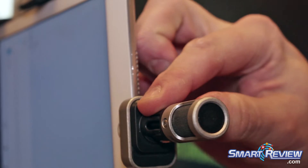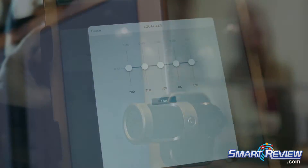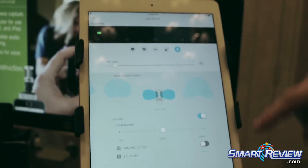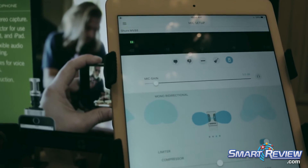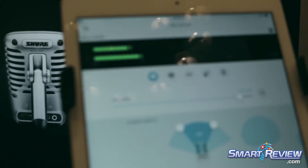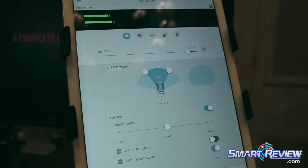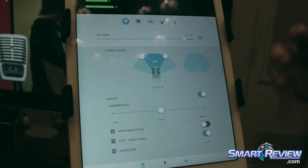Furthermore, there is a limiter and a compressor and a five-band EQ and some other great settings in here, so you can really customize all the bells and whistles. If you don't want to deal with that yourself, we've included a couple of quick-touch DSP modes. Say you're doing a voiceover — all you have to do is press the speech bubble and that'll do some behind-the-scenes settings. We have some really nice live metering here as well. Putting it in speech mode will apply a voiceover-type EQ, changes the compression a little bit, just changes the way it sounds.